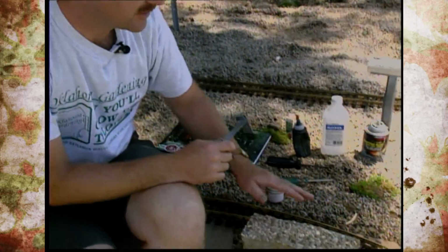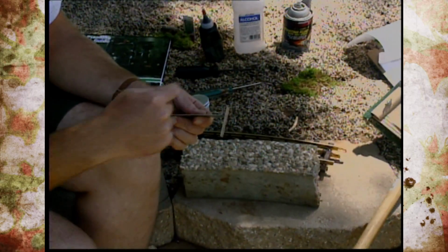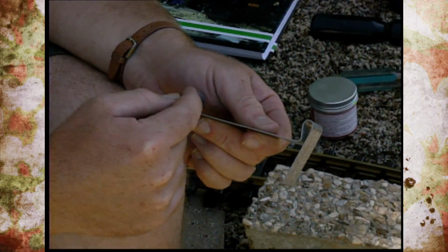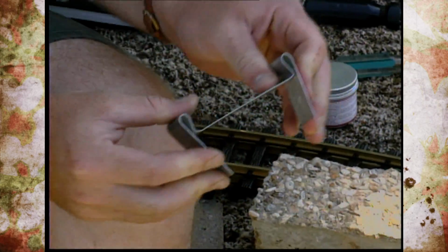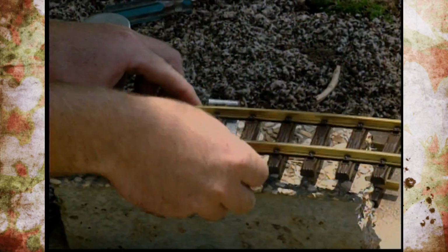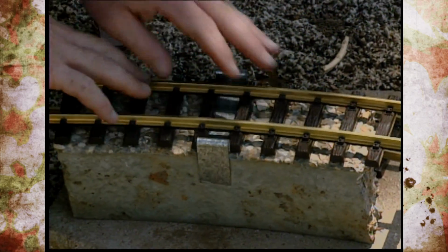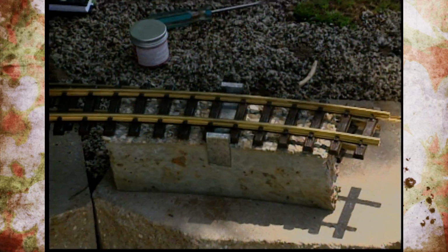Well, placing the track onto this, it was very simple. He had designed this galvanized strip, which is a 1-inch piece of galvanized that is 10 inches long, and the critical measurement is 3 5/8 in here, which allows the track to clip to it. Then you just spring these in, and they just clip over the side of the block, and the track just clips in. This allows movement of the track, which is just like what the big railways have, is the track moves when that train rides on it. And as that train comes around, it just works slick.